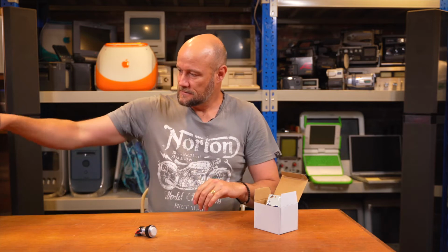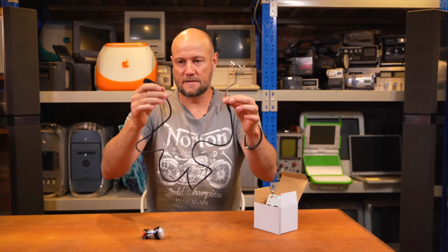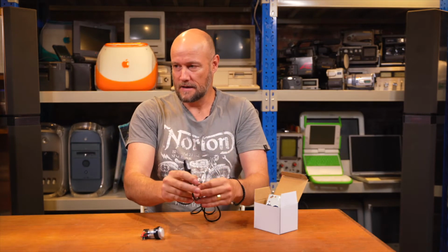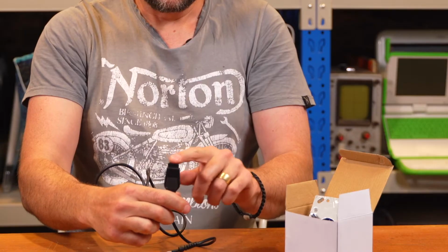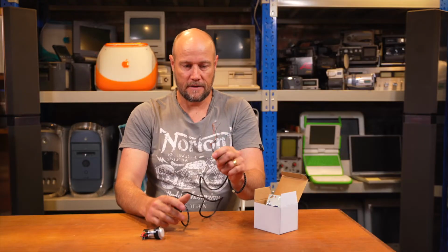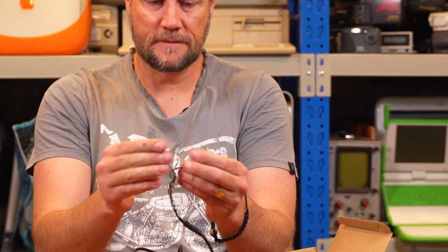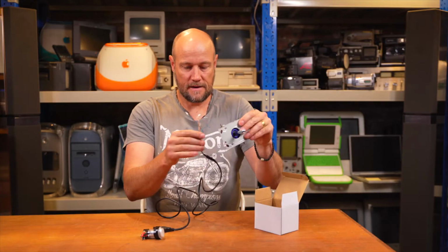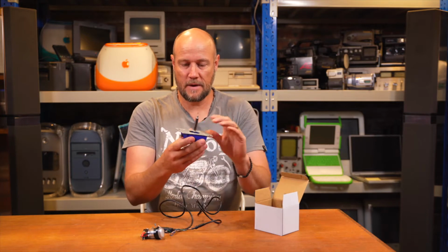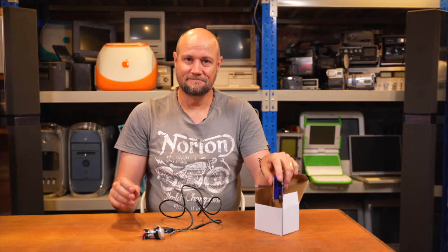The other thing I've got, untangle it here, is I salvaged this off an old joystick I had, which has the D-sub-9 connector on one end and the 5-6 wires that I need on the other. So we have black, which is the common, and these are the directions and the fire button. So I have to wire them all up to this and put this in a housing. I was going to make a housing out of timber, so I've got some wood lying around. I'll have a look through what I've got and see what kind of housing we can come up with and build our joystick.